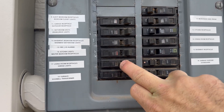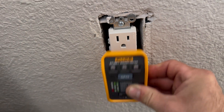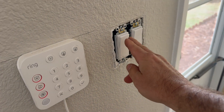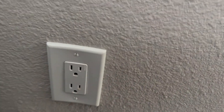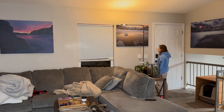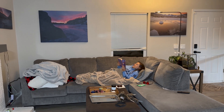Power back on. Our switch is in the off position — power to the bottom one, no power to the top one. I turn the switch on and we've got power. I've got my covers on and now I'm going to plug in my light to the top receptacle. So now when my girlfriend wants to turn on her reading light, she doesn't have to stand on the couch — she can just hit the switch to turn the light on and off.